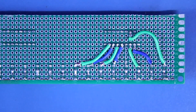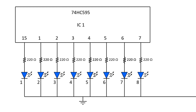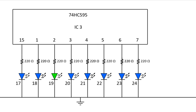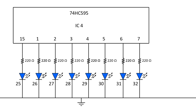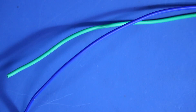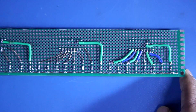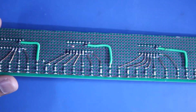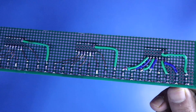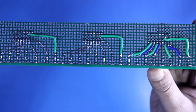We have to do this for all of them. The first IC controls LED 1 to 8. For the second IC it controls LED 9 to 16. The third IC controls LED 17 to 24 — and here you can see LED 19 is the green LED. The fourth IC controls LED 25 to 32, and the fifth IC controls LED 33 to 37. Instead of using regular wire, we can use copper wire, and I have connected the rest of the connections with copper wire because it is much easier to work with. This is how I completed the connection between the IC and the resistors.